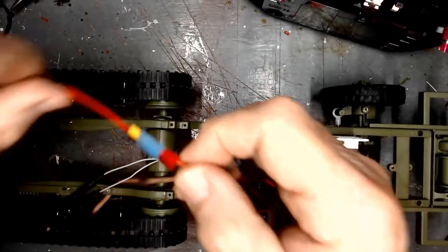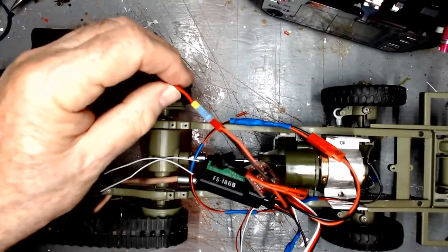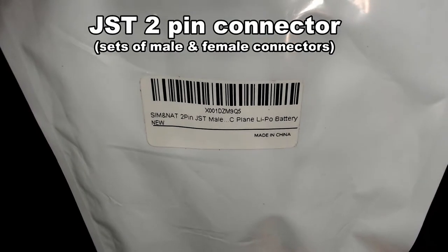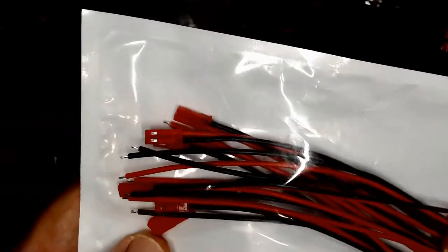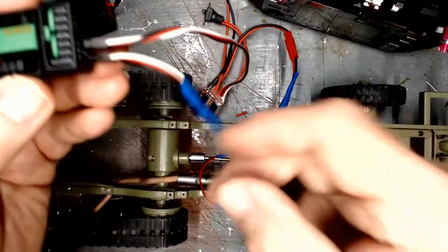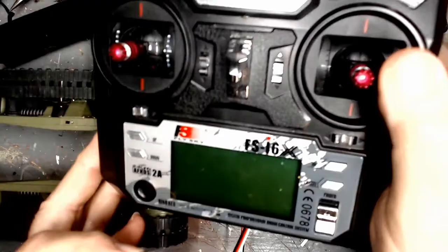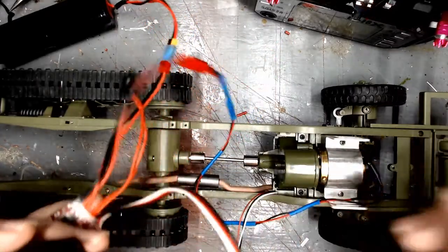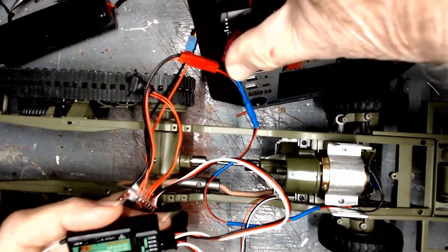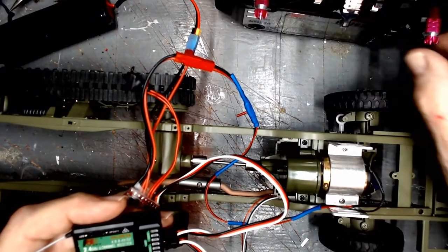Here's the same connector mounted into the battery — I have a box of them, quite convenient. You can buy these on Amazon: a 2-pin JST male seaplane LiPo battery connector box with male and female connectors. I have channel one going to the servo for steering left and right, and channel three going to the speed controller which goes to the motor. So I've got forward, neutral, reverse, and left and right.